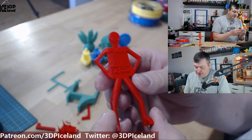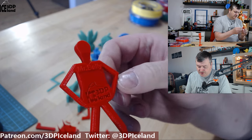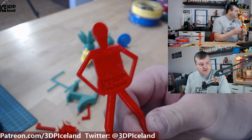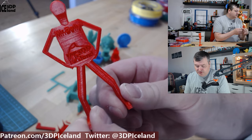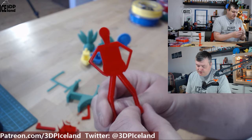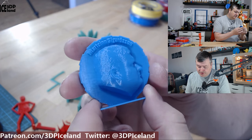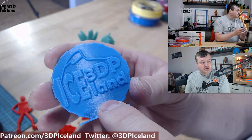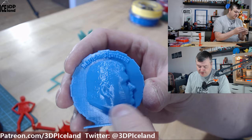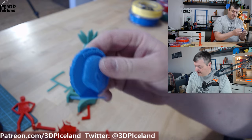I printed Misty Belly and that also came out pretty good. There was a small amount of stringing — maybe the only real issue I could find with this filament — but the feet are really strong. Often I can break them off very easily, but with this filament they're quite strong, so that test came out excellent. My MakerCoin also came out excellent — very smooth and the letters on top came out really clear, so details were very good.